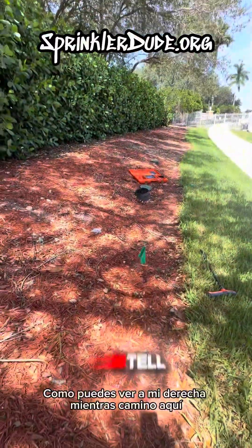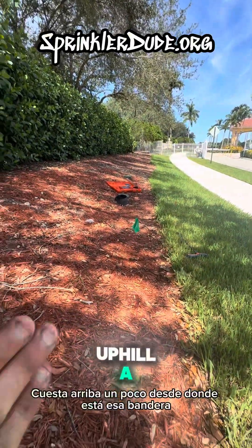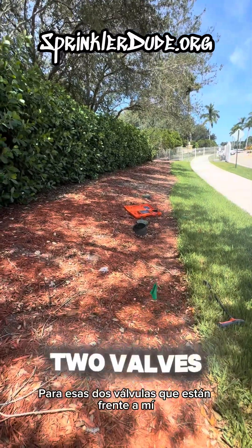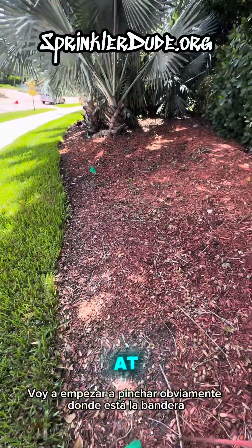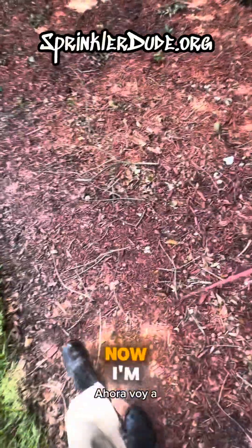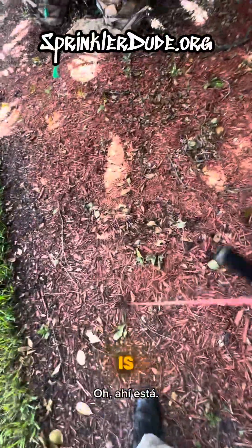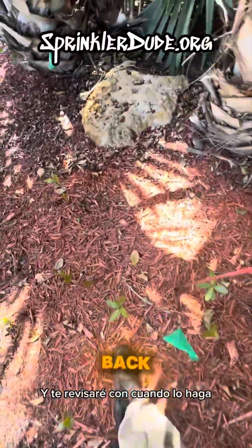More specifically, to my right as I walk here, because that valve is offset uphill a little bit from where that flag is. So that means the main line is running here, and they set all the valves on this side of the main line, from what I can see for those two valves in front of me. So when I go this way, I'm going to start poking obviously where the flag is, but also to the right because that's where I believe the valve is going to be located. I didn't have anything that popped up on my locator to tell me 'oh, there it is,' so I've got to do this the old school way. Poke around — we're going to find it eventually.